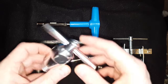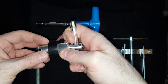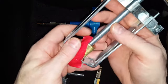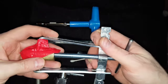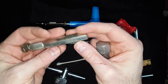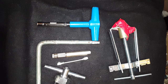This one is an extractor for shower faucet cartridges. Another extractor here. Various nipple extractors of different sizes and different types. Basically you tap it into the nipple — whatever you're trying to get out — and then you use a wrench to turn it counter-clockwise to get it out.